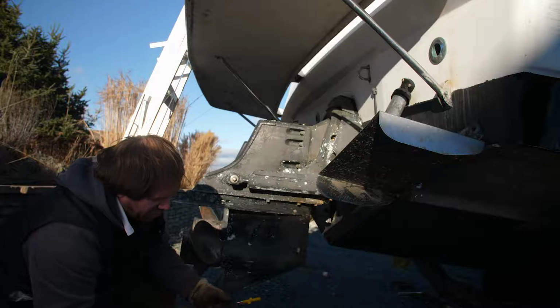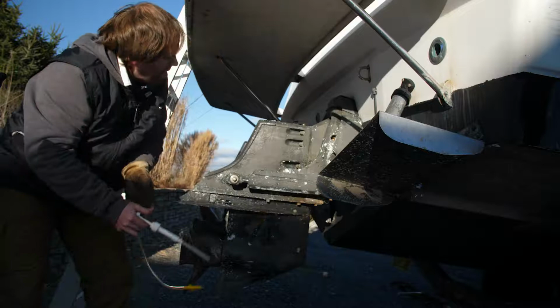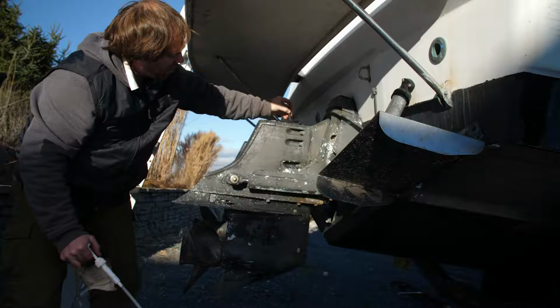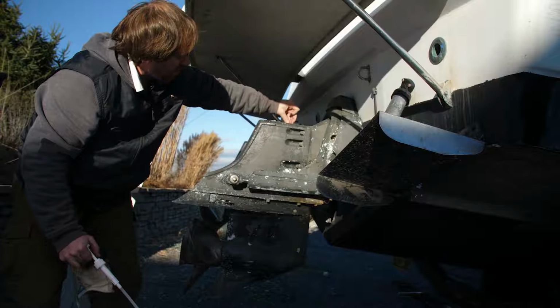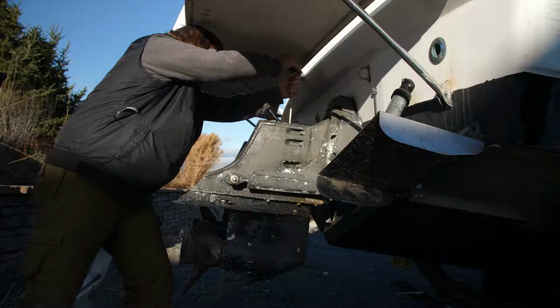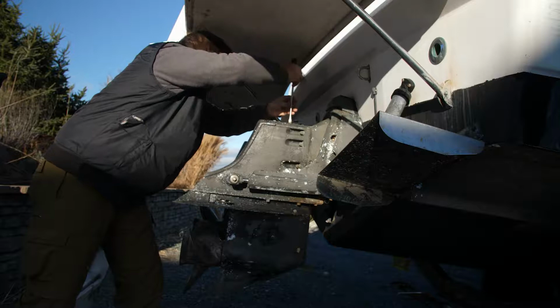And as you're nearing the specs for the fill amount, you want to be checking the level on this quite often. So I'll just leave that sitting in there, thread it in a few, and then look to see where it just starts to hit the bottom of the pin. And then once it's threaded into the bottom of the pin, I'll tighten that in all the way, so that it's sitting at the proper level to get a good oil level reading. Now I'll pop that back out. And I'm sitting right there at the mark with the oil level, so that's perfect.